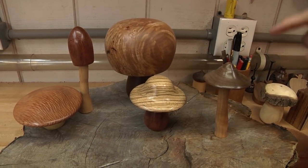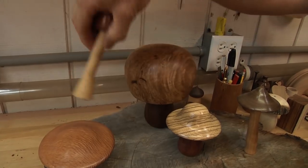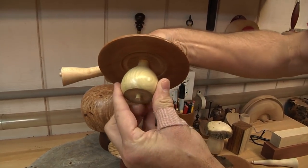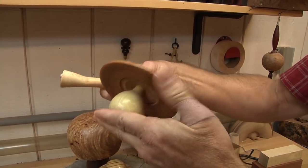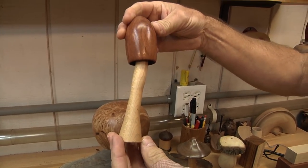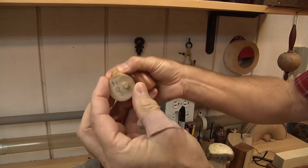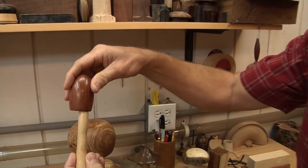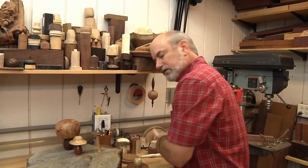You can see you can make all sorts of sizes, shapes, and looks. We're going to start with these two right here. This is a little short squatty guy — you can see I have a tenon on each end, and that goes in there like so. This one is really unique because look at the shaft — it's all wonky. That's because we're doing off-center turning with it, and then we're going to make a cap that slides over it.